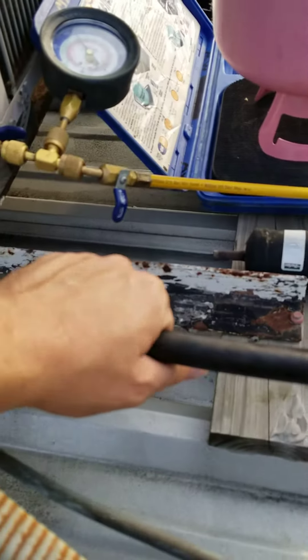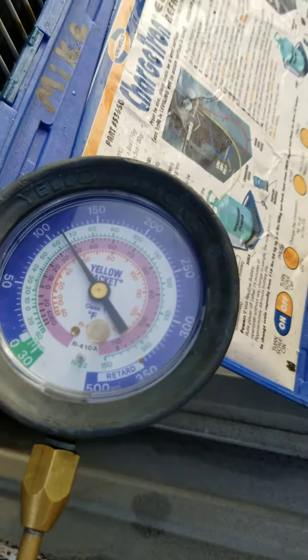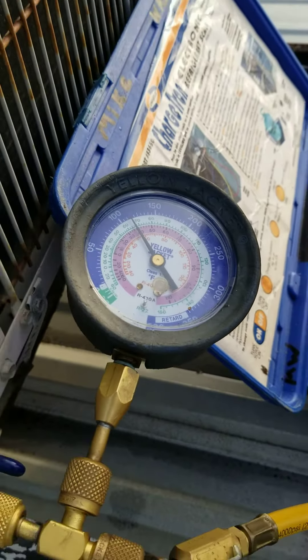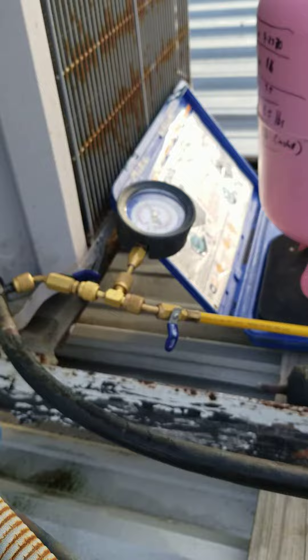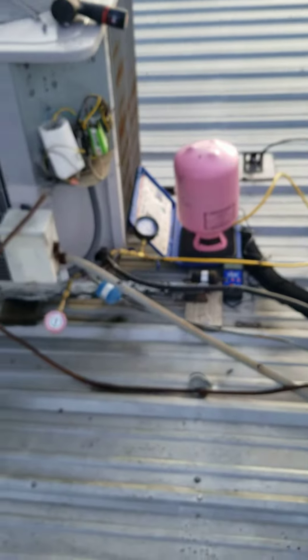Give me two pounds. We're already chilling back — that beer-can cold. About 40-degree coil. Since we're already chilling back, I may go check that coil and see if it's just filthy dirty, see what we have going on downstairs. But at least they're cooling now. Anyway, just a quick video — like and subscribe, that's what's up.